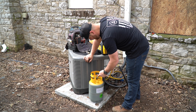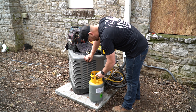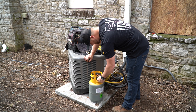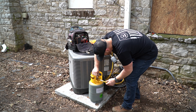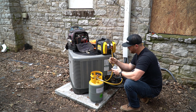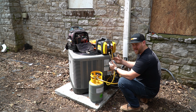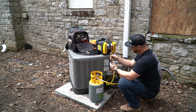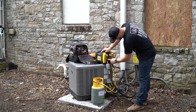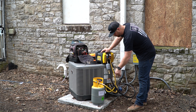As far as the connection on the recovery tank itself, what I like to do is hook it up to the vapor side and then turn the tank upside down — that seems to help the recovery process. I'm going to remove that 45-degree fitting so it comes straight down and puts less stress on the fitting. I've got that reconfigured the way I'd like it. I went ahead and purged all the air out of the lines all the way up to the tank, so I'm ready to turn this thing on.